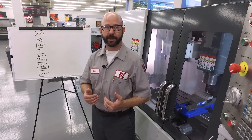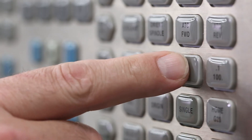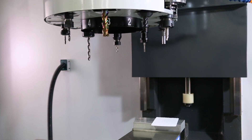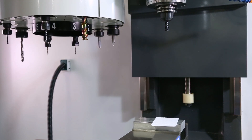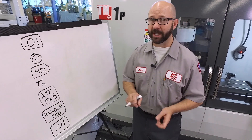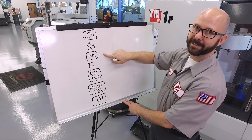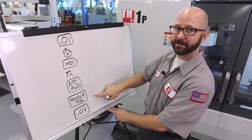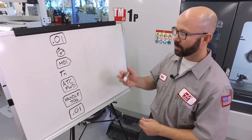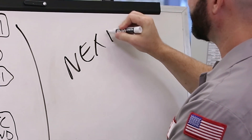Now if you're setting a tool offset manually using the tool offset measure key, you can either do all of this or just do this. We just set tool one using the tool offset measure key. Now if we don't use the next tool shortcut key, you might find yourself pressing jog forward, then pressing the hand jog key, then selecting another jogging increment, before jogging tool two down above the part to touch it off. Well all of those button presses and functions can be completed with a single push of the next tool key.